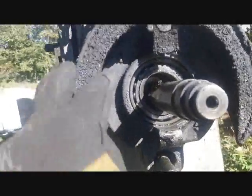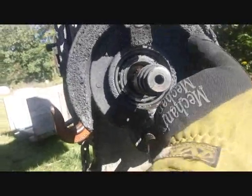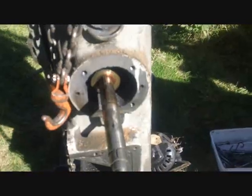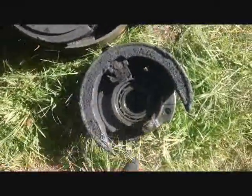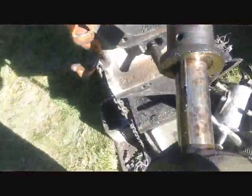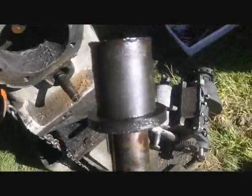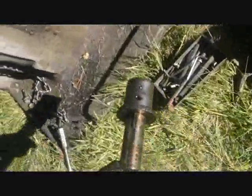Now it looks like there are four screws in here that hold this assembly on, and what's interesting is a couple of them are really loose — as a matter of fact, all of them look pretty loose. Those four screws remove this whole part, which is also the bearing carrier. And once the bearing carrier is out of the way, this whole shaft just slides right out. So this whole back shaft is one piece — this shaft comes off, and that of course is what was keeping this from coming out.